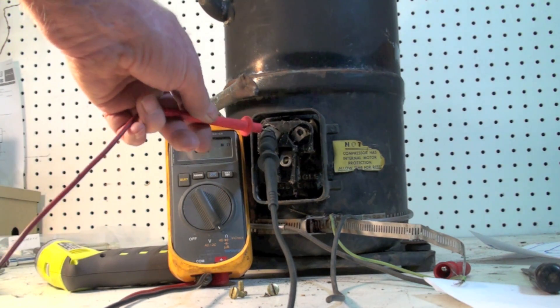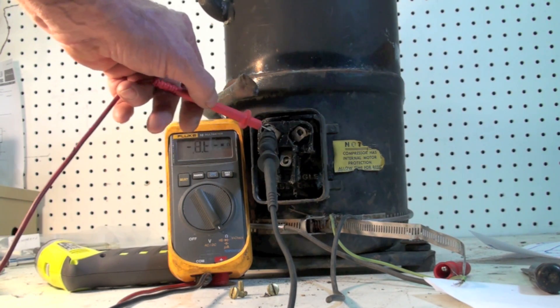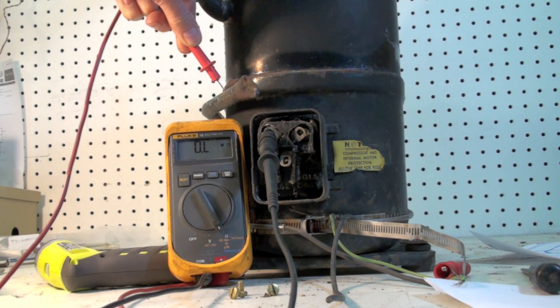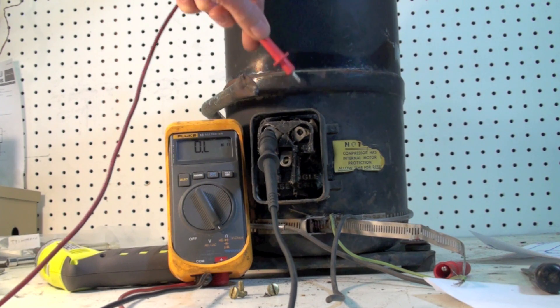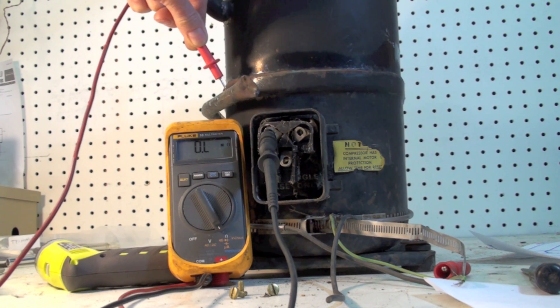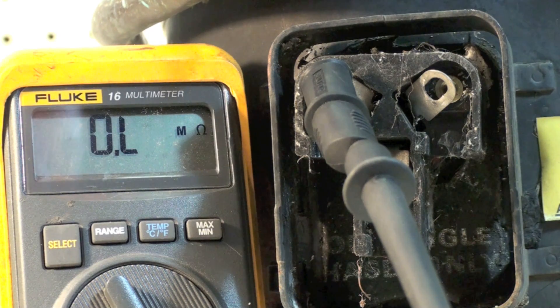The way I do that is I put this terminal on one of the windings. I know the windings are all good, so any one of them will do. I've cleaned off a spot here with a knife and I'm checking to see if this is grounded to the chassis. I don't do it on painted areas — I want to do it where there's a good connection so I can read whether these windings are shorted to ground. The megohm symbol beside it means there is no continuity. There's none, so that means there's no short to ground.